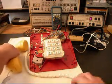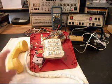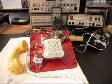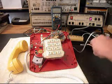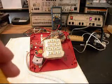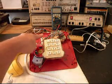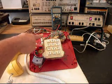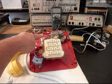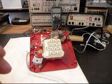So we know that this telephone is dialing out, it's receiving, it's transmitting, and it rings in on a ring cycle. What we can do now is push this button on the switch box, and that totally takes the analyzer out of the situation and gives us a line out. Give you some dial tone. We'll call a time and temp number, and they're having problems with their equipment. So you'll hear the recording start, and then there'll be a hum, and then the recording will continue. So we'll go ahead and do that now. Give you some dial tone.